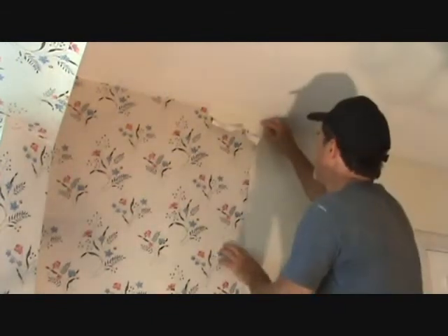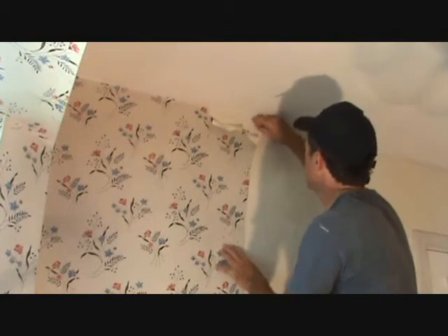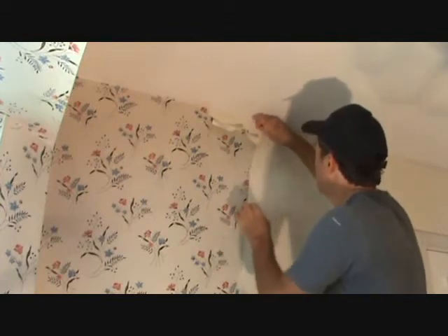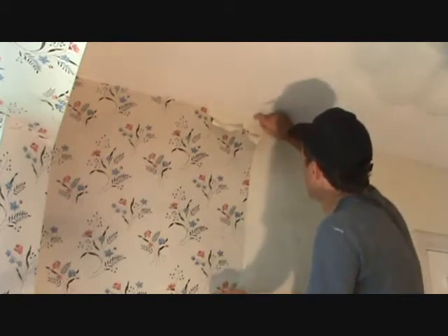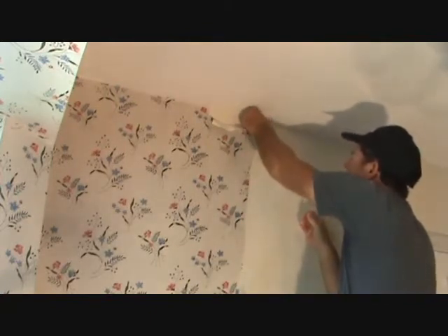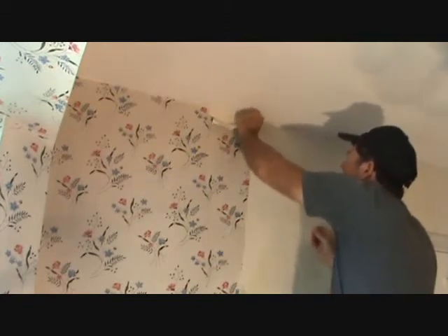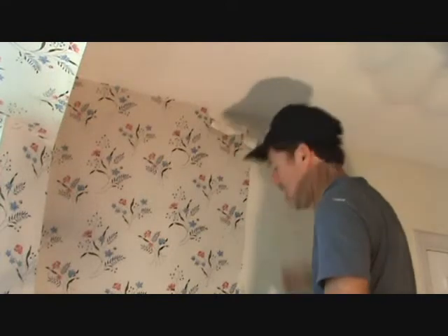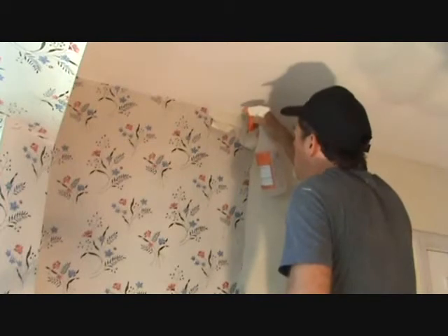When I take off this little strip, I can see where the back side of the paper is, and I can kind of get that off just with my fingernail. Once it gets wet, do it that way if you have fingernails. Because it's easier to kind of get it rather than trying to dig your putty knife up in there. Make sure it's wet — it looks like it needs a little bit more water up there, especially where the backing paper is.